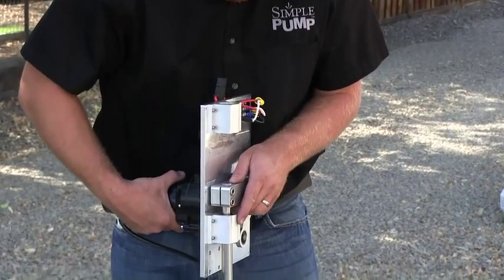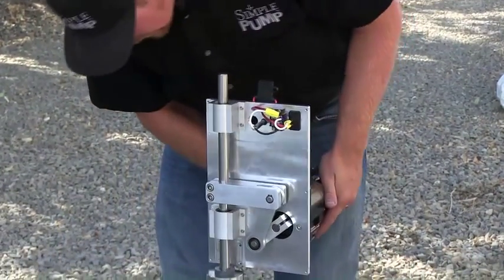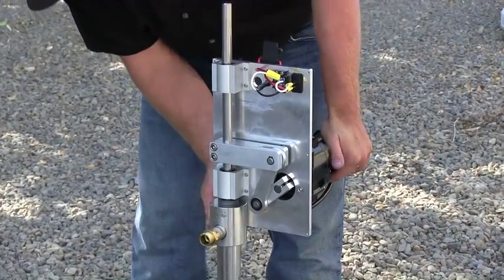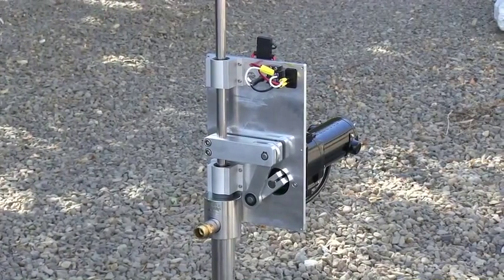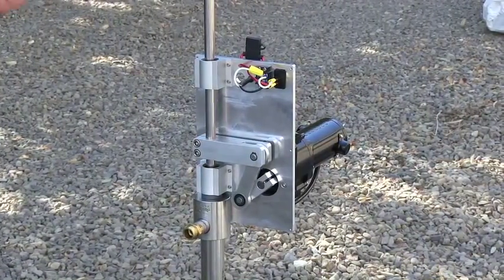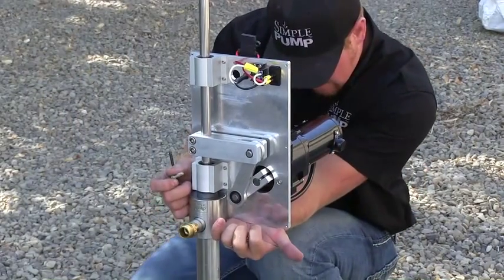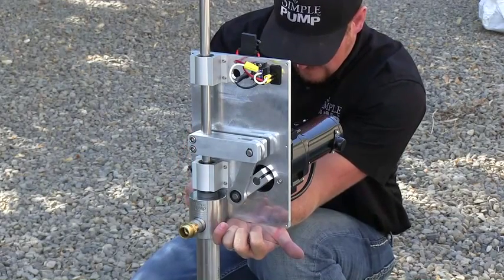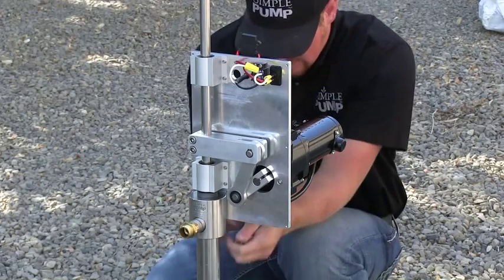The first item that needs to be oriented is placing the stainless rod over the first linear bearing, over the yoke, and then the second linear bearing. We're lowering the mechanism down to where the four mounting bolts are aligned, which would be at approximately a quarter inch of space between the bottom end of the bearing housing and the top of the rod gland. There are four fasteners that are then connected to hold the mounting plate for the linear bearing link drive in place.